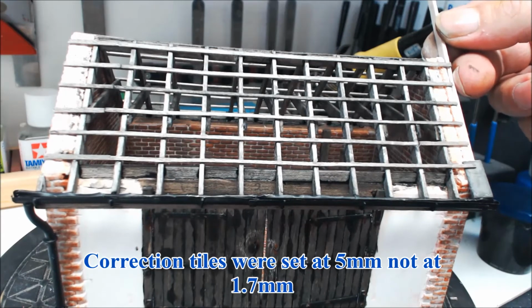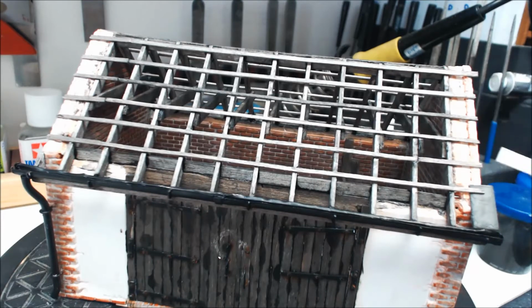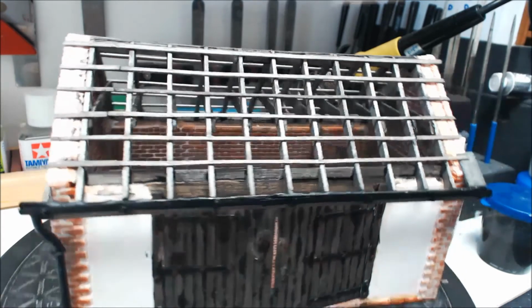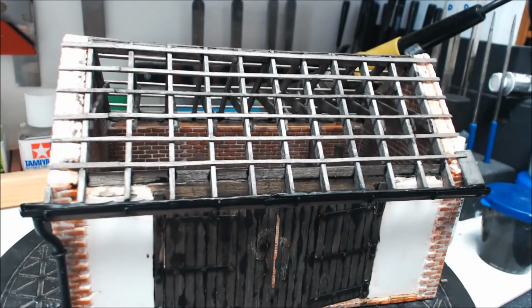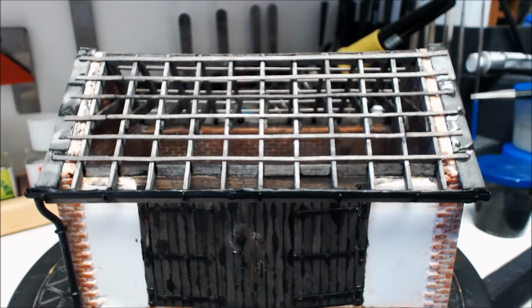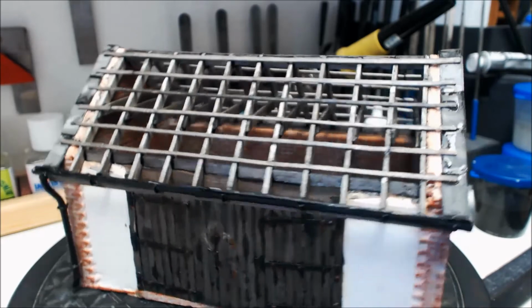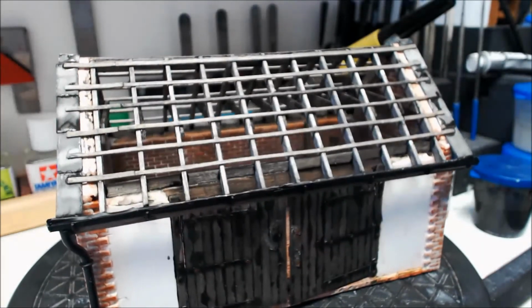So I'll be just giving it that little bit of an overhang, and that will be for the cement work for when we're finished. So what I'm going to do now then, I'm going to run coarse tiles up there, down that side, up that, and down that gable, and then I'll come back to you and we'll go on to the next bit. Right, I've glued the gable end starter tiles on both sides there, that end and that end. Now we can start putting tiles on.